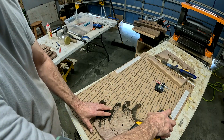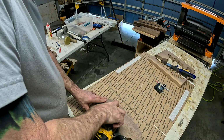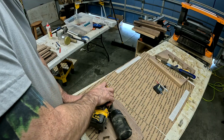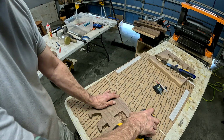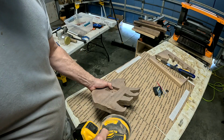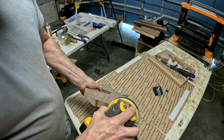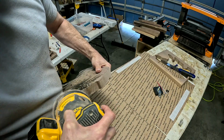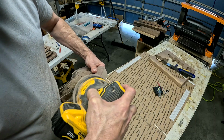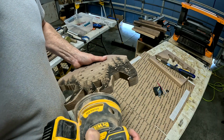Now the sander, if you're not careful, or if you are trying to not hit your burnt area, if you hit your burnt area with your sander, guess what's going to happen? You're going to knock the burn off of it and you're going to have nice clean wood under it. So you got to be careful to leave the burn in, but not leave the resin on, if that makes any sense. Now some of these, like anything I do with trees and stuff, I'll show you the finished product here in a second, but when you hit over them, if you take a little bit of that burn area off and leave some brown shining back through it, it actually helps highlight it and make it stand out a little bit better. But again, if you dig in too deep or if you tilt the sander up and down a little bit, you're going to knock out the black and it's going to look pretty bad.